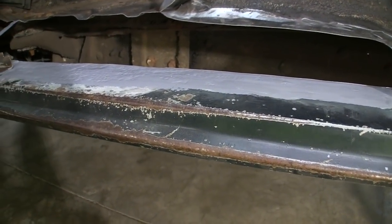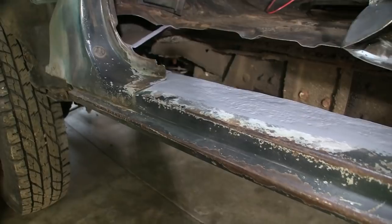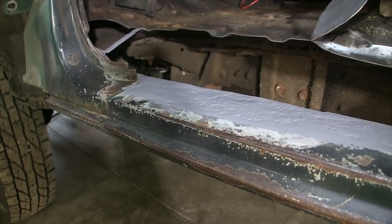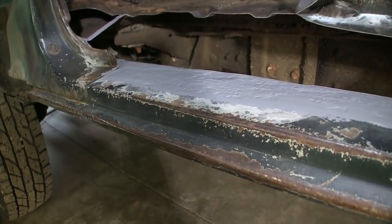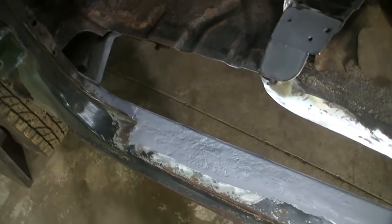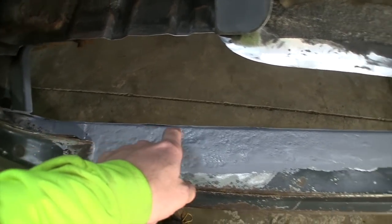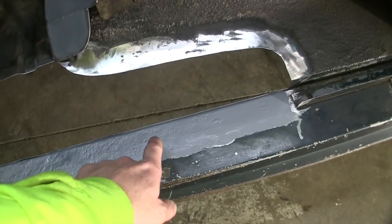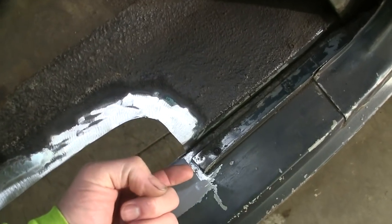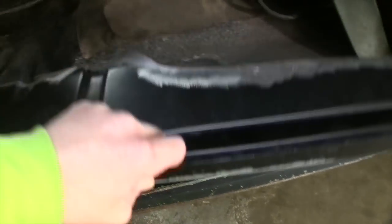This is also an old work truck. If this was a restoration job, they'd take a different approach. I would pretty much force whoever's having me do this into doing the rockers and everything. That way I know I'm starting with fresh metal everywhere. All in all, it's pretty clean. But I just wanted to show you guys that little bit, because usually in between a panel you would put weld through primer, zinc type primer, but in this scenario I really have no way to get anything up and under that lip, and that I will show you here.